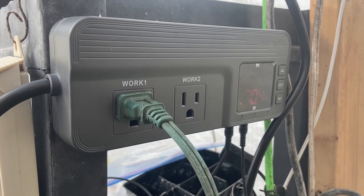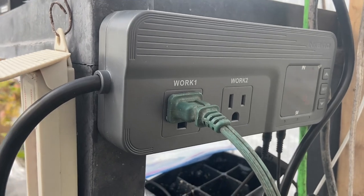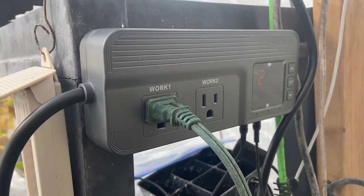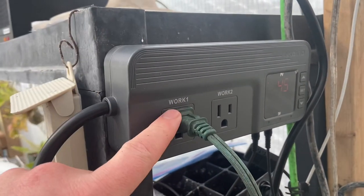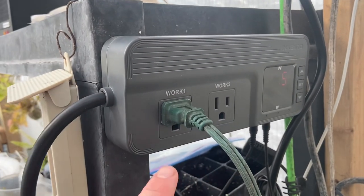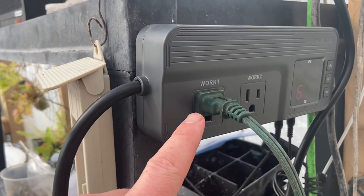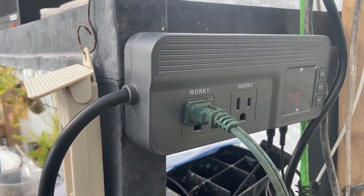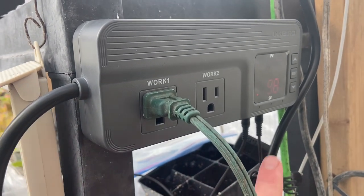It's simple to set up, and if you long-press the set button you can change the differential as well. So if it's set to 26°C and you want it to come on at 28 and cool back down to 26, you can do that. This works for both heating and cooling — with the long-press set, your menu comes up and you can choose either heat or cool.